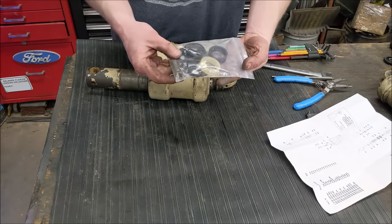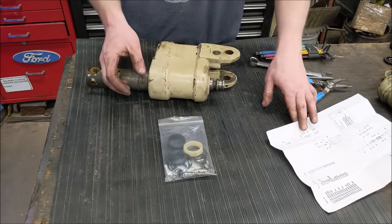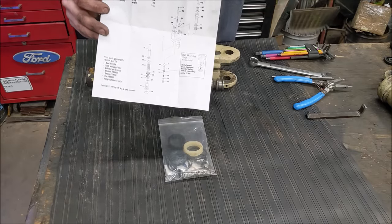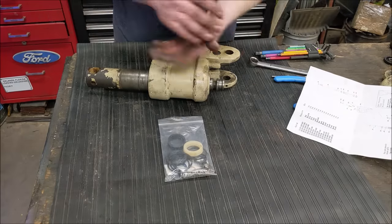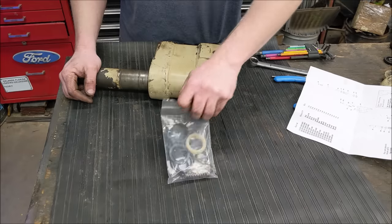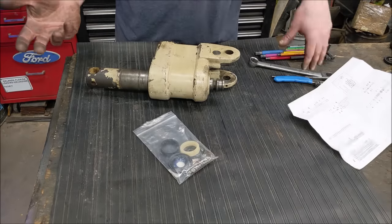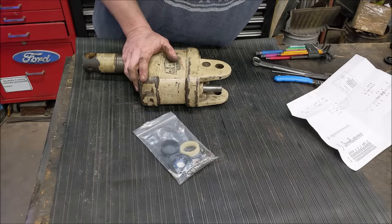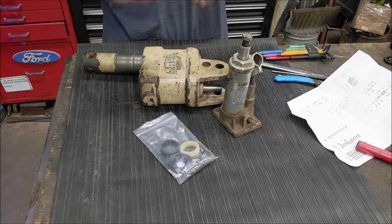When you do find a kit, it's just a bunch of little seals, some check balls, copper washers, and a spring — nothing to it. Hopefully they'll give you a parts breakdown diagram, because what I find in most jacks I rebuild is that people have put stuff in backwards — especially the check balls. I don't know why people always put check balls in backwards, but they're almost always backwards. It's good to have a breakdown to see exactly what you're doing. The principles are exactly the same as a bottle jack, just scaled up so you can actually find parts.